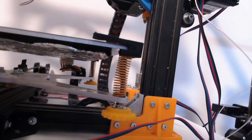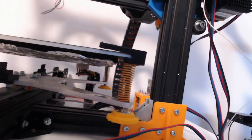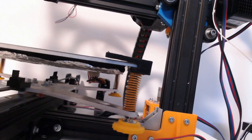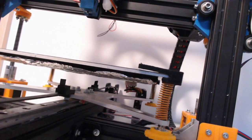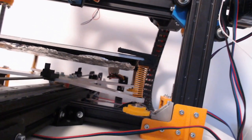And that worked fine, though looking at the springs when tensioned, I recognized they bent out a little bit. And another thing I think is probably a problem when the bed moves faster and there's more mass. Because of the longer screws, it may introduce some kind of wobble. To solve both problems, I thought some stabilization of the springs could help.